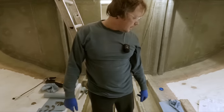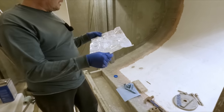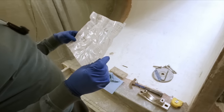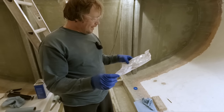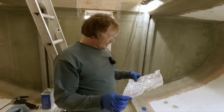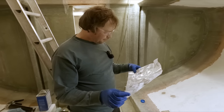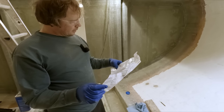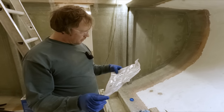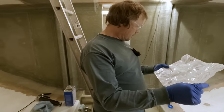Okay, so the first thing the instructions say to do is to put these labyrinth seals on, which we did by cheating. So we took the easy route. Saves some time. The next step would be the pedestal base and lower half flange, but that's going to go on last because of the way that we're doing this. So we're going to start next with the inner race. So let's see, we've separated it.